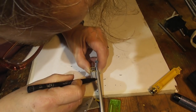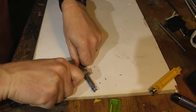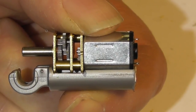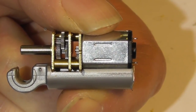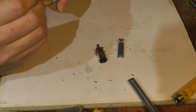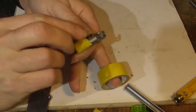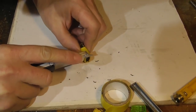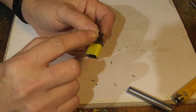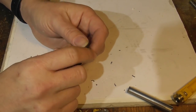I'm happy with that, and then I'm going to want to trim the whole thing off right at the very end of the motor — and that looks as if it's going to be absolutely fine. Cleaning everything with some alcohol, then get some yellow tape pulling it nice and tight. We don't really need any excess on this so I'm just going to chop it off. I think that's a reasonably neat job and that's certainly not going to come off there. In the final stages I'll probably put a couple of cable ties around which will help tidy the wires as well.